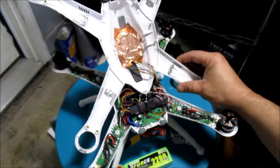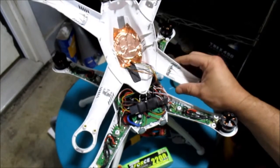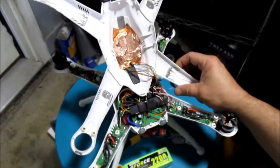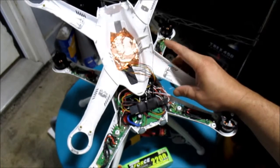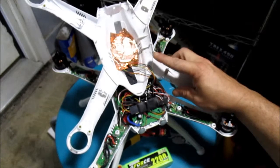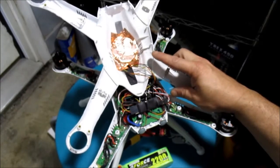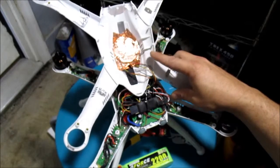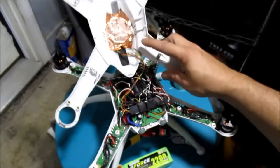I had to switch back to the Walkera GPS. I put some copper tape on there to reduce RF interference. I had to use the Walkera GPS because the other one wouldn't fit inside. I used UCenter and the 3DR text file to write to the GPS unit using non-volatile memory to put the settings in and change the baud rate to 38.4, and now it connects good.